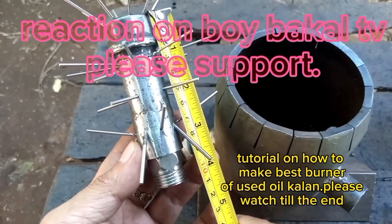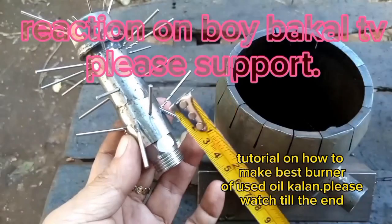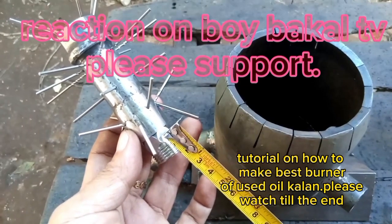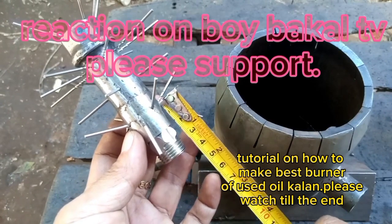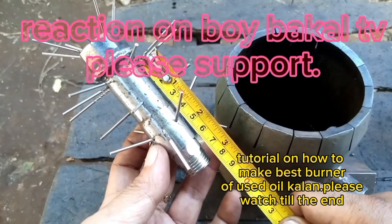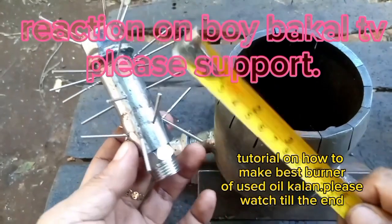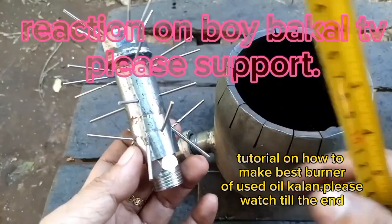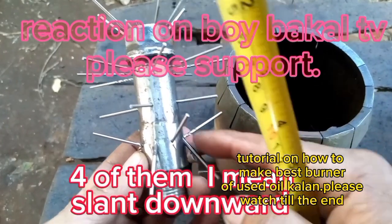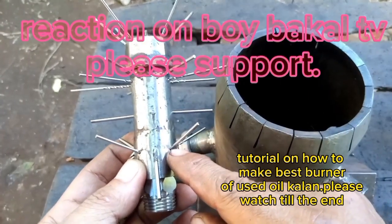That's how I do a super blue flame use oil stove. The first layer is 2 centimeters from the base — the base is labeled here. Next layer: 2 centimeters. Next layer: 2 centimeters. Up to the top is 1 inch. The first layer has eight holes, 2.5mm, slanted downward, and in between are 2mm holes slanted slightly upward.